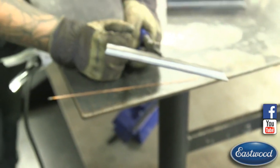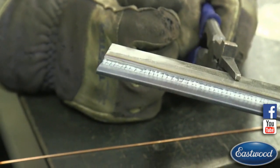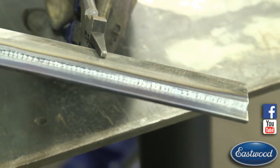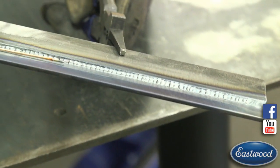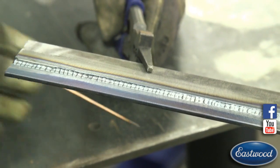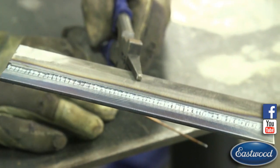The piece, you can look at the weld here and see. I'm going to try and turn it so you guys can see how it's curved into our piece there. So when you're looking down it, you want that. You also want this line on the bottom here where the other edge of your weld is. You want that to be pretty straight along as you're going. But you can probably hopefully see in there how that's filling into that piece.